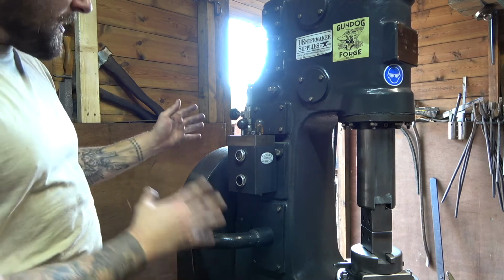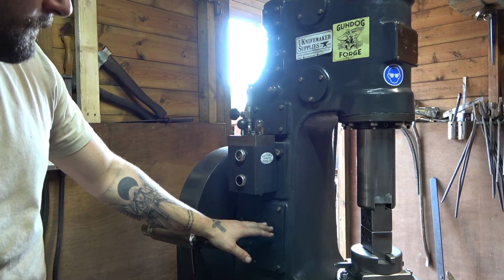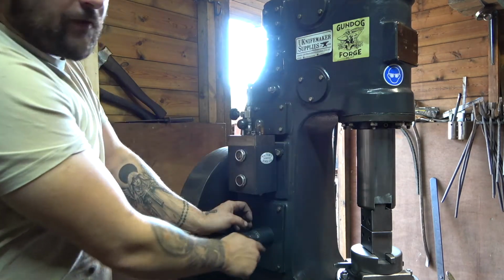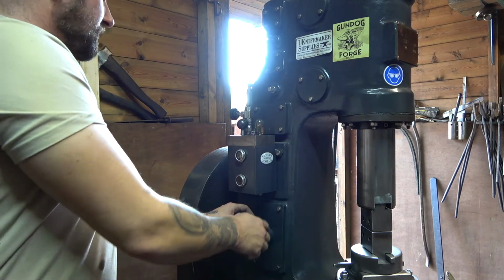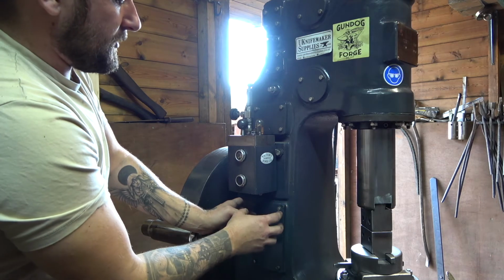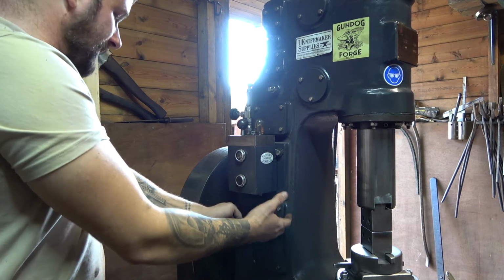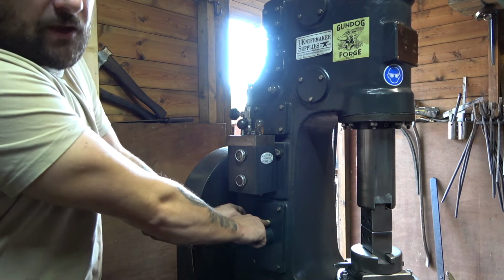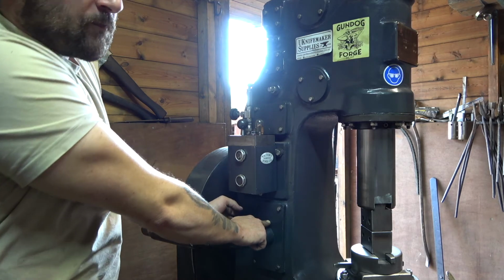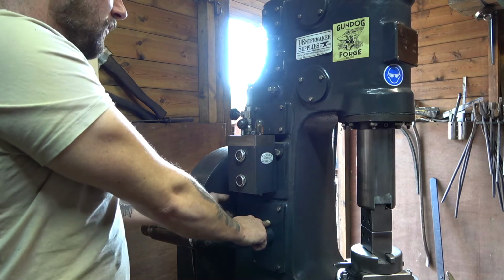On this side, this is where your inspection plates are for your greasing and that lot. Behind this one, if you take it off, it'll be for the main bearing for your pump end. So take this off and you'll see the cap bearing on the ends, and then there's a grease nipple, depending on what part of the world you're from, what you call it. Behind there, you put some grease in once every 3 months, I think it says, but it's entirely up to you. Grease and oil is cheap, power hammers ain't, so I do mine quite often.